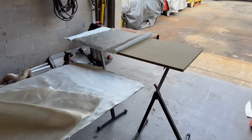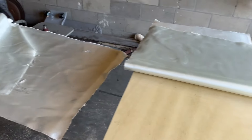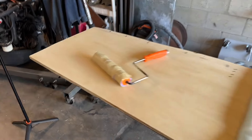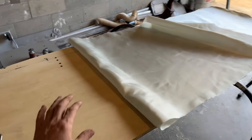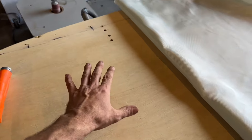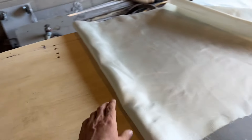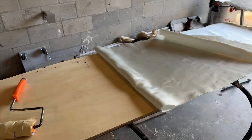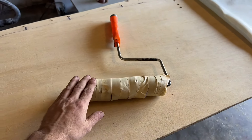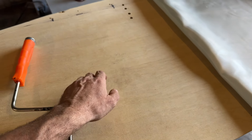We got our cloth cut down and fitted to our floorboards. We've got it laid out before we get going. We've got to mix up our two-part epoxy, and we're going to wet in our board first. Once the board's all wet in, I'll let it sit for a couple minutes and then lay the cloth on top. And then we'll wet in the cloth on top of the board. That just helps the resin soak into the wood a bit more rather than robbing it from the cloth, and it also helps the cloth adhere to the wood while we're laying our resin coat on top.